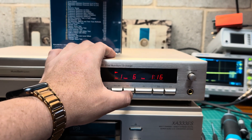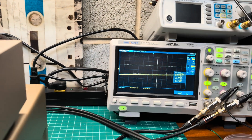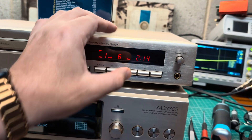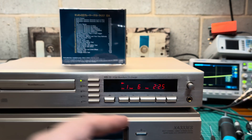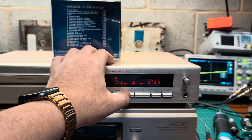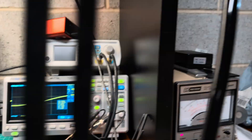Scrolling to the next — I believe it will give 8 Hz, and at 8 Hz we are already here with a pretty strong signal. The oscilloscope says below 10 Hz it can't measure. Next one would be 17 Hz. Yes, you see — 17 Hz, and the level stays smooth, we are pretty good. That's why I'm measuring with oscilloscope and VTVM, because it's more precise than using the T100 software. Next will be 31 Hz — yes, that's 31 Hz, and the levels will be the same.